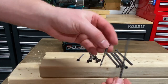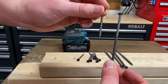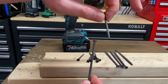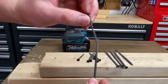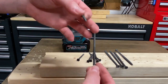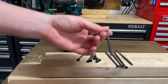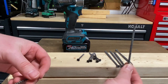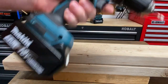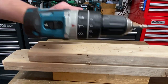Okay, now let's change this test up a little bit. Let's try a lot longer screws. I'm going to change the clutch settings on all the drills to number three, because some of the drills are able to sink the smaller screws near perfectly in lower settings. Clutch setting number three should do about the same on the larger screws — maybe some drills have higher clutch settings designed for larger screws. So I'm going to do the exact same test with five larger screws, going in the exact same order as before, starting with the Makita XPH-12.